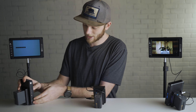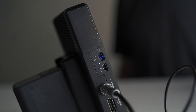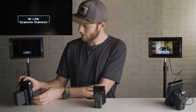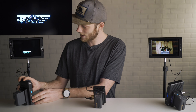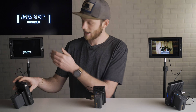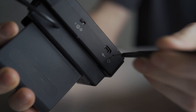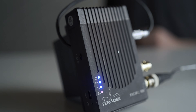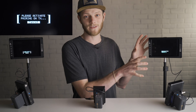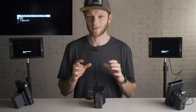We're going to go over to our second receiver and power it on, leaving the other transmitter and receiver on as well. Once this gets booted up you can see we have no signal — no link. We're going to go into the menus again using the joystick, hitting right and then scrolling down to the pairing setting. Click down on the joystick and it's saying to activate on the transmitter again. Push that little button — you'll see those five blinking red lights and you will lose signal on your original receiver setup, and this is okay. It's just going to pair these two together and then once it's all done they'll both be connected to the same signal.